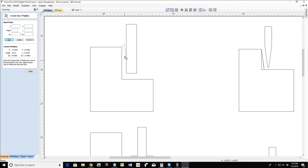It could cause chipping in that upward motion. As it's pulling up, it's also pulling that top part up, creating chipping at the top. And so if I'm doing a cut where I want a nice clean top surface, maybe it's a joint like a dado or a rabbet, then I'm typically going to use a down cut spiral, because the down cut spiral is pushing those chips down, keeping the top of the cut nice and smooth, rather than pulling them up, chipping away at the veneer or the top surface.